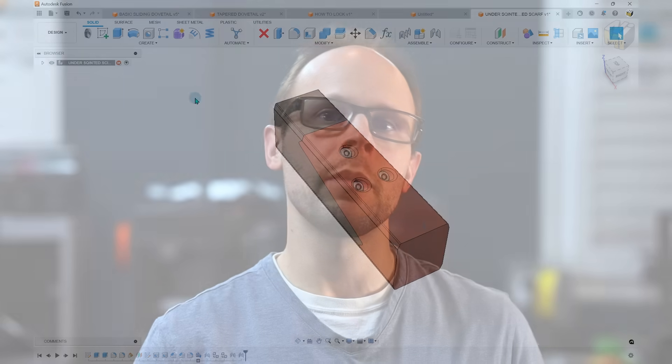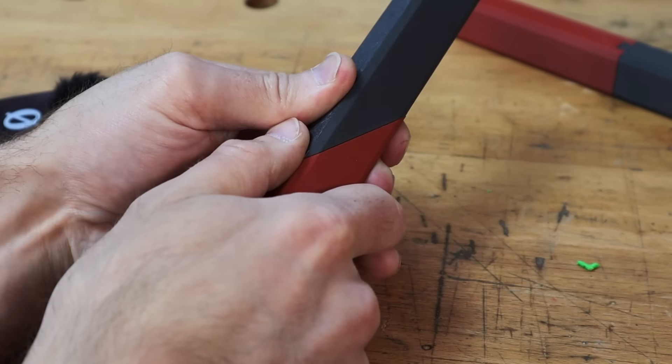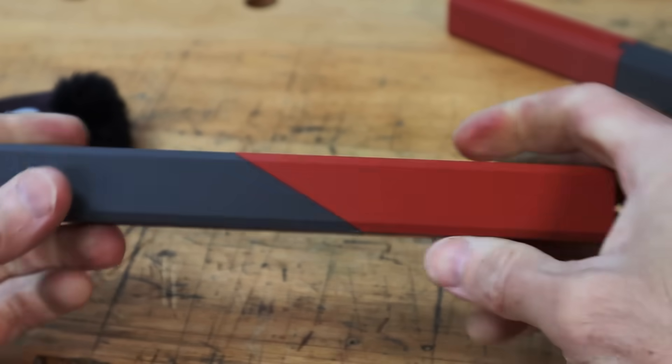For anyone looking for strong and tight screwed connections, I'm working on a video on that topic, but for now I'm sticking with no fasteners and no adhesive. The idea is to pull those parts together and keep the joint as tight as possible — if we can do that they'll act more like a solid continuous piece and not like two separate wobbly pieces. Looking at the dovetail, the wedge shape causes the dovetail itself to compress and the walls around it to push outward. The walls need to be quite a bit larger to withstand that force, but I have an idea to help prevent this problem.